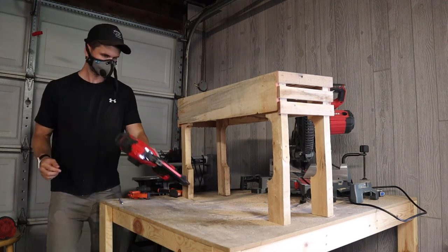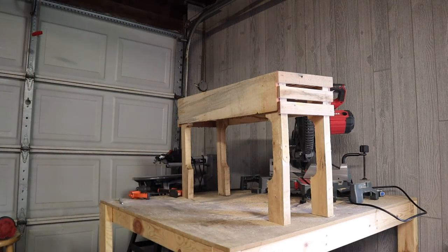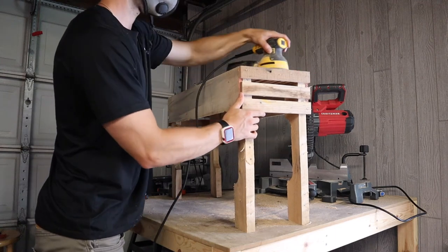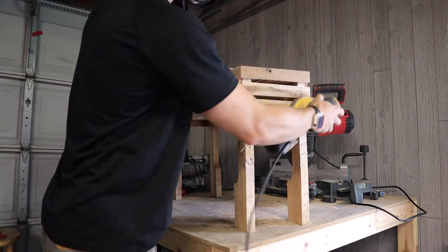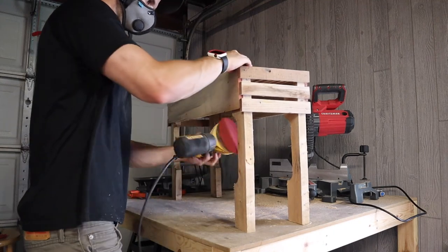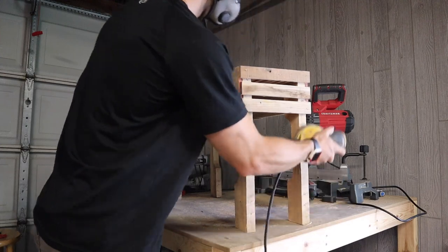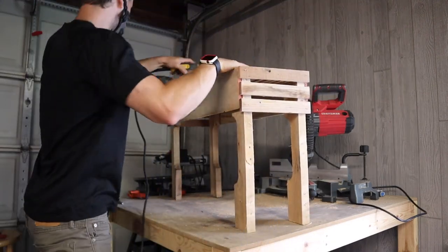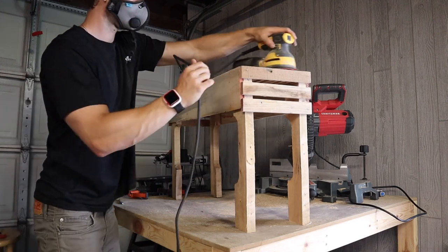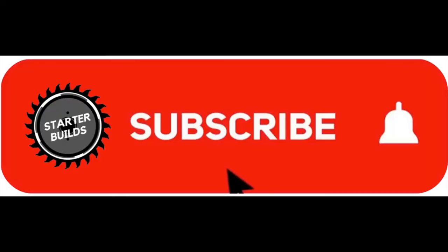For a free project, I don't think it's a bad build. You could put it outside your house and put some planters on it, or you could put it inside your house and use it as a bench to put your shoes on. Finally, I'm going to go ahead and sand this down — I started with 60 grit and worked all the way up to 220 grit. You just want to ensure that you sand as much as you can, because this is pallet wood and it's normally super rough, so you don't want anyone to get a splinter. Hope you guys enjoyed this video — feel free to give this a thumbs up and be sure to subscribe to the channel. Thanks guys.